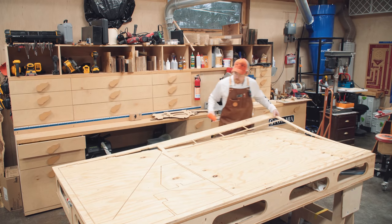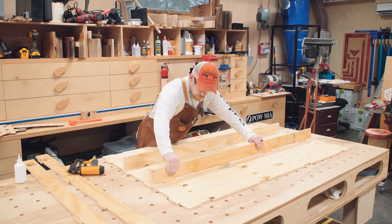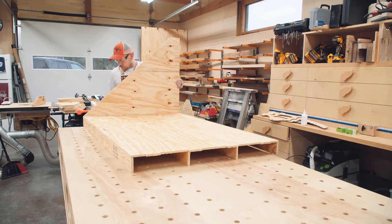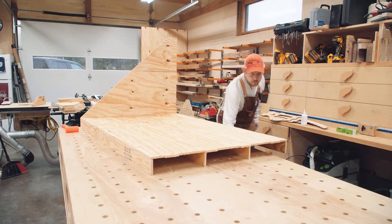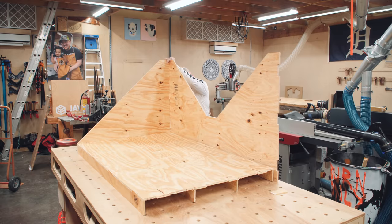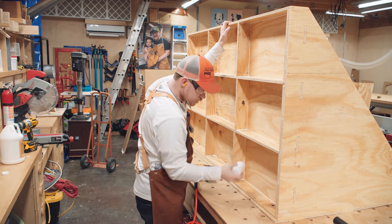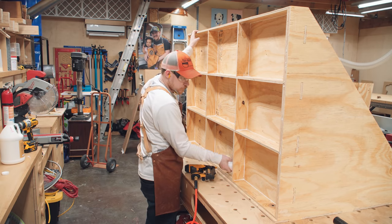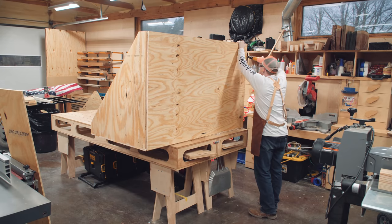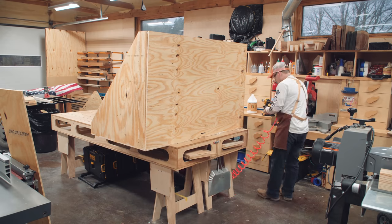I used the CNC machine to cut out all of the pieces while I finished breaking them down and prepared everything for assembly. For increased strength without a lot of weight, I went with a torsion box style platform, which is where the assembly starts. Then the sides and back panel can be added. The platform connects to the sides with mortise and tenon joints, and to the back panel with a wide face glue connection. The sides connect to the back panel with a few finger joints. Next, the assembly is flipped over on its back so that the platform interior webs can be added, and I made sure to use way more glue than necessary, as any extra glue would just act similar to caulking around all of the edges. More glue and the bottom of the platform is installed, using nails to hold the pieces together just until the glue dries. The main holding power comes from all the glue after it dries.